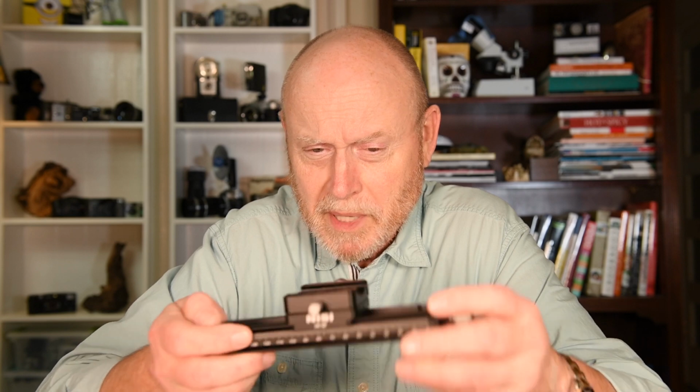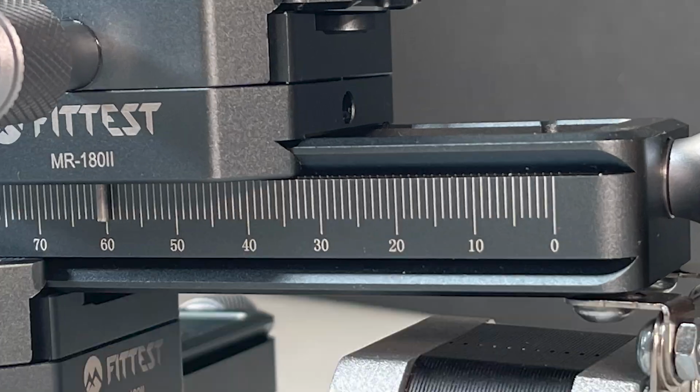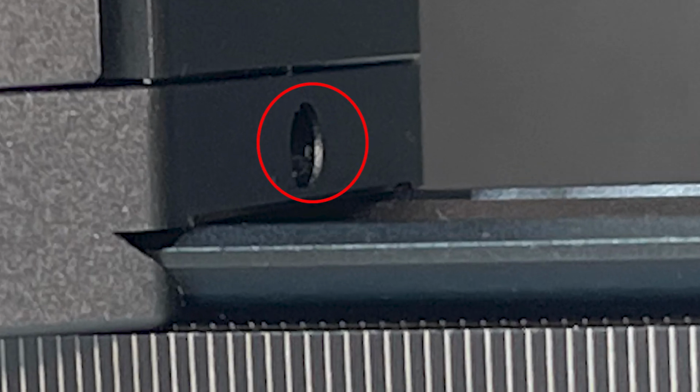It turns out, I took mine apart to get to the bottom of what exactly was going on. And it turns out that in some of them, during shipping, there's a little grub screw at the very bottom of this hole that works its way loose. And when it does, the ball screw loosens. Now, it's a piece of cake. It takes 2 seconds to fix. But if you don't know about it, you wouldn't know to fix it. So about 4 or 5 people got in touch, and you just put an Allen wrench down there and tighten it, and Bob's your uncle, you're good to go again.